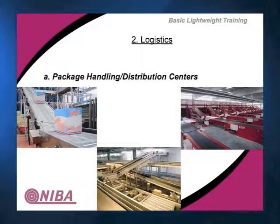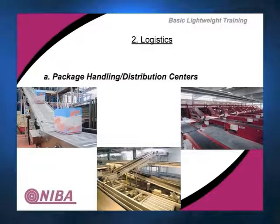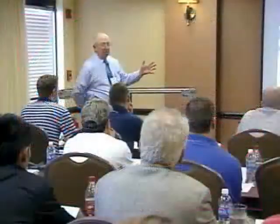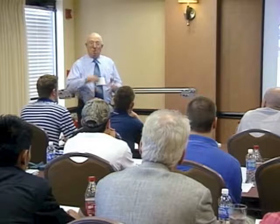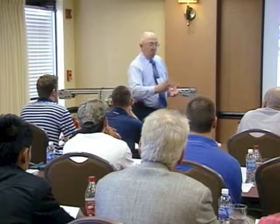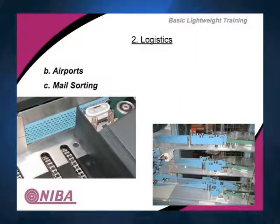In the old days this would have been a two-ply or three-ply rough top belt, but now we see modular with rubber inserts. Everybody knows the big names — the FedExes and UPSes — but all major big box companies like Best Buy and Walmart have major distribution centers with belt in them. There are curved belts in here that you can look for — they don't use plastic modular on those, so that requires something specific. Further in that, we go into airports. Both of these pictures are actually mail-sorting applications.